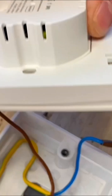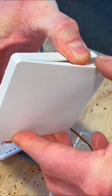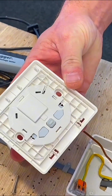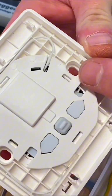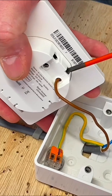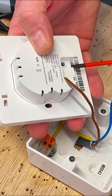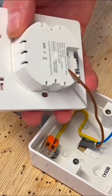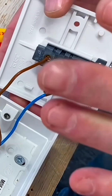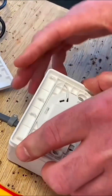We have to separate the two, so just be a bit careful and gently pull the switch front off the body — it should just come away with a gentle little wiggle. I've separated those two, and that gives me my two fixing screws when I need them to hold it into position. I've just got to make my connections on the back now, and the switching line — remember that is not a neutral. This doesn't need a neutral, which makes it fantastic, because lots of times there aren't neutrals at switches. Once connected, this will be exactly the same as it was before: a one-way switch operating that light. We'll introduce more switches afterwards.